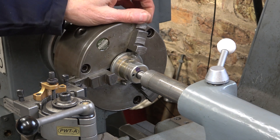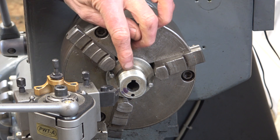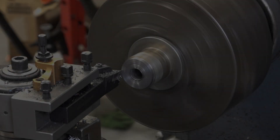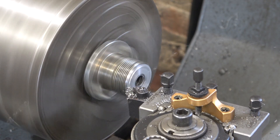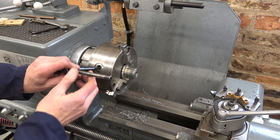I'm just using a 14mm drill to centre this in the chuck. The batteries have gone on my mag light, so that'll be another odd job. I'll take this in 6mm at the edge to start with, so I've got something to work to — only half mil cuts, there's no prizes for pulling it out of the chuck. I took five off, chamfered the inside and the out, and now we can drill it for that gas barb.